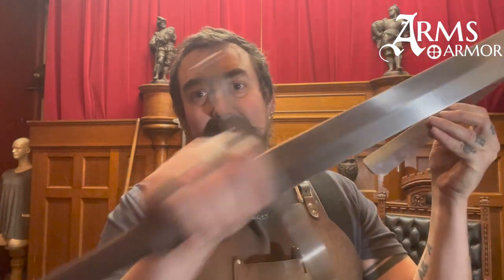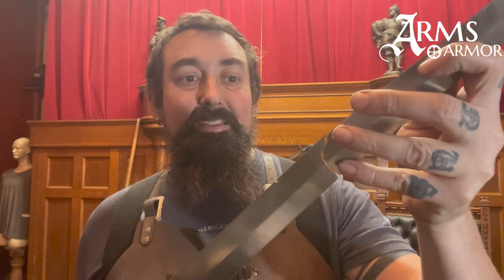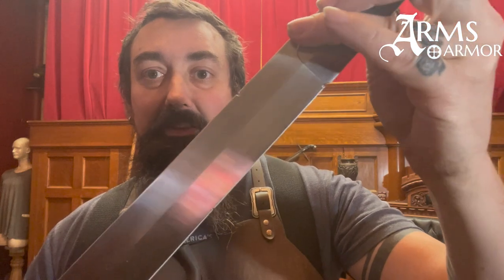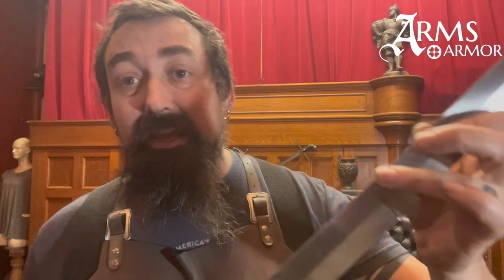This is my sword that I was doing a whole bunch of tests with, and you can see that it broke. It didn't break because of anything wrong with the sword — the grain structure is beautiful, there are no flaws in it. It broke because of that chip right here. That was a deep wedge cut into the edge of the blade by the other blade in our test. I was then doing more testing without grinding out that notch, including hitting armor and trying to cut through cloth armor with the damaged blade. When I did a fairly powerful cut against a piece of cloth armor on a dummy, the blade just fractured and broke.